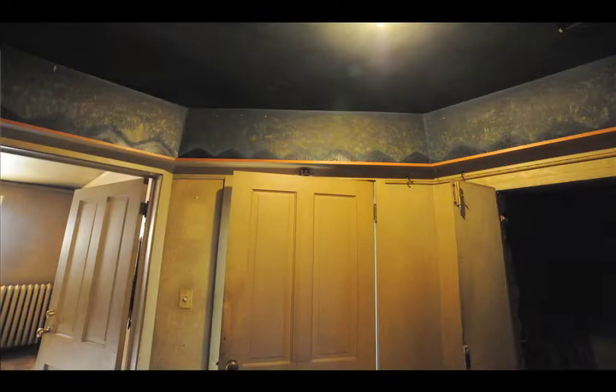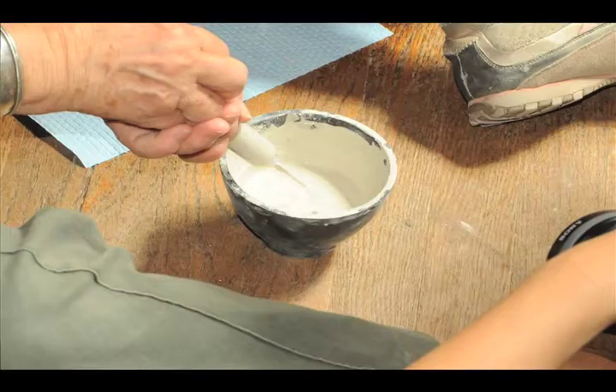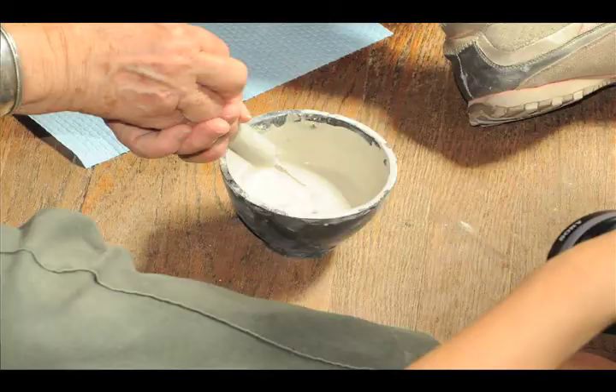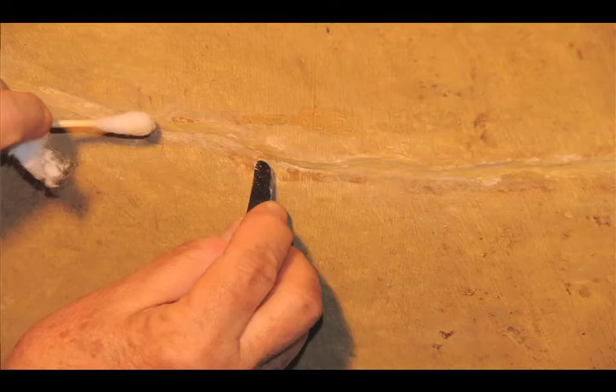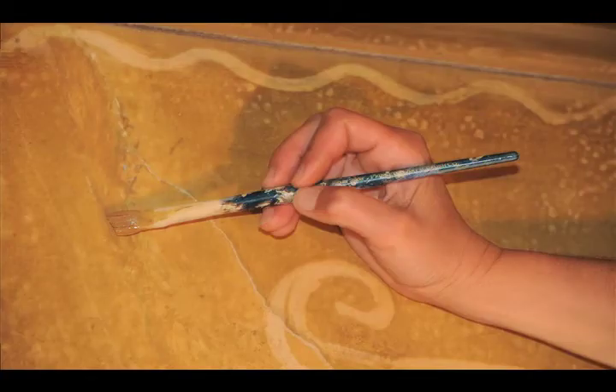With these huge cracks, we've been using hydraulic lime in an injection method to go into the adobe walls, penetrating them and making a structural infill. We've been using hydraulic lime because it doesn't take oxygen to cure, so it can penetrate deep into the adobe walls and still dry up nicely, giving us a nice surface to work on with a lighter putty and infill the surfaces to match the finishes around the house.